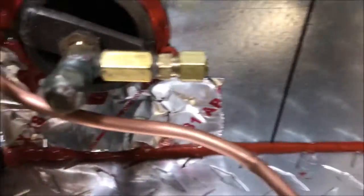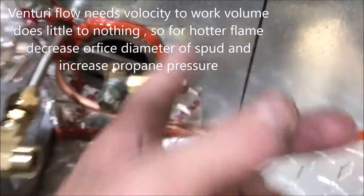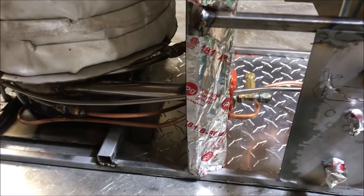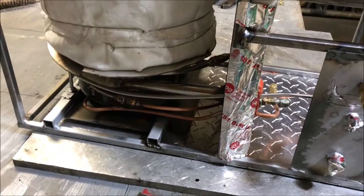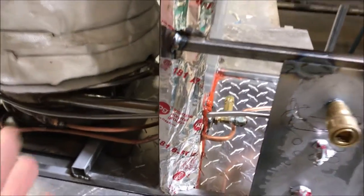You can see what I've got going on here — it's not hooked up yet — but because this spud is going to be running at 80 PSI, the amount of air that is going to pump into this cyclone burner is about 10 times what most burners run at. Most propane burners I think run around 15 PSI — I could be off — but I just wanted to share that with you guys.